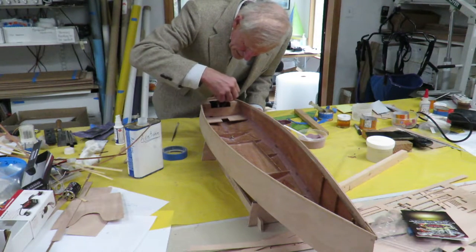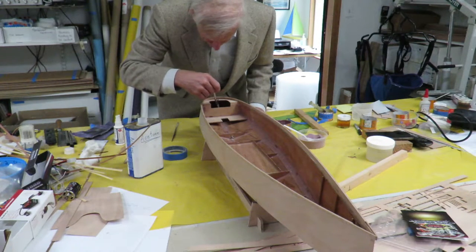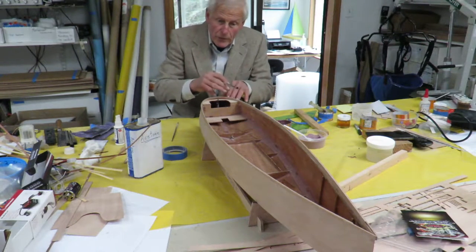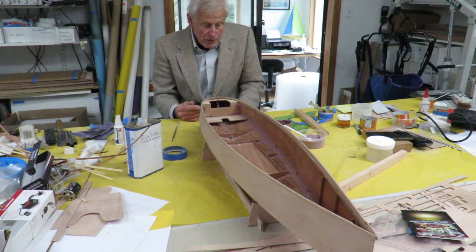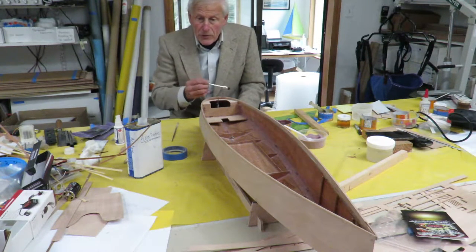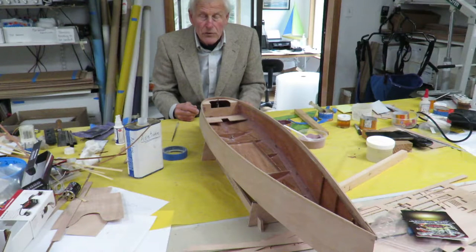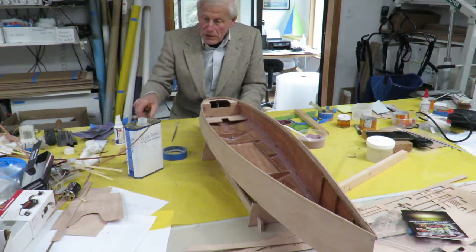Start moving your fillet up the sides of the rudder tube, filling in between the rudder tube and the rudder support column. At the top, bring the epoxy all the way around the front of the rudder tube so you have a collar of epoxy all the way around. That way the rudder tube can never pull away from the rudder support column without breaking that collar. Make sure you have epoxy filling all the way up both sides — in case you didn't get a total seal at the bottom, you don't want any water coming into the boat.